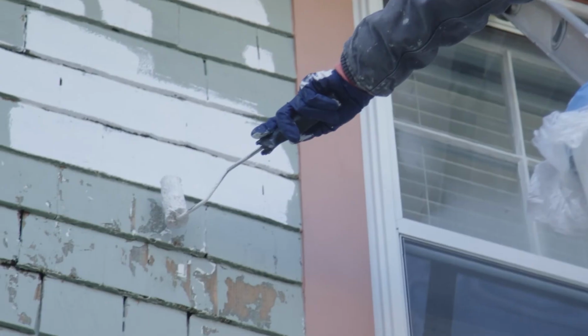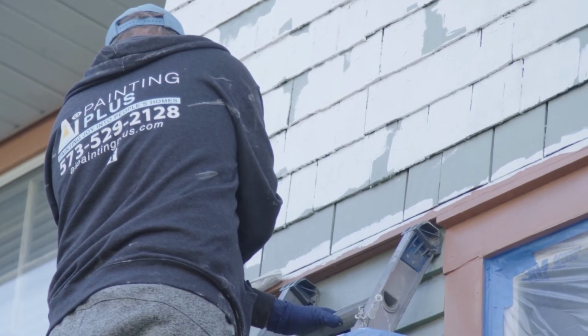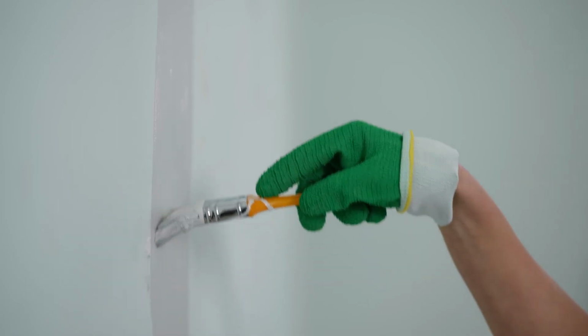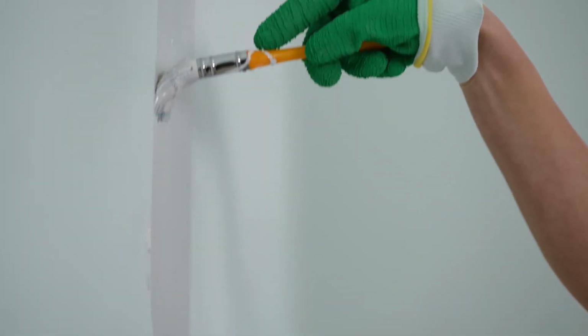Also wear gloves. The solvents in oil-based primers and shellac are really volatile, and they do actually seep into your pores. Somebody told me this one time, it was actually a makeup consultant, that the things that hit your pores actually absorb into your bloodstream within like 20 seconds. Think about the damage that can cause. Wear gloves whenever you're dealing with this stuff, like cleaning up with your paint thinners or your denatured alcohol. You do not want to submerge your bare hands into these things. That can also cause chemical burns, irritate your skin, all kinds of different stuff. It's just not something you really want to mess with.